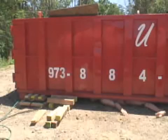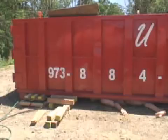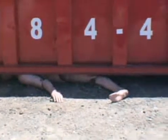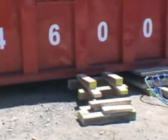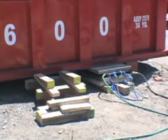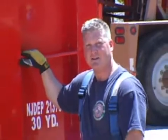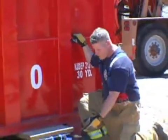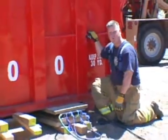In this scenario, we see our victim is completely pinned under the mid-span of the dumpster. We opt to use a multi-point parallel lift. We could use a single point lift, but we'd have to move our lift stack in order to extricate the patient, and in the event that this dumpster was unevenly loaded, our lift could become unbalanced. We've positioned our bags on the extreme outside of the span, just in front of the dumpster's rollers.